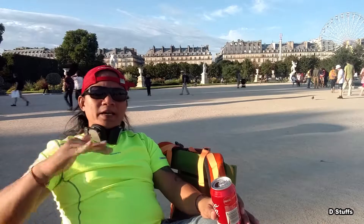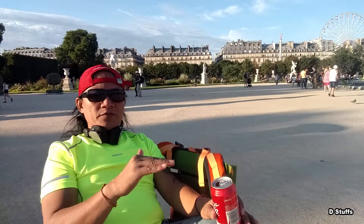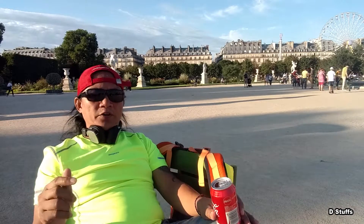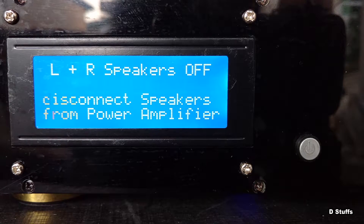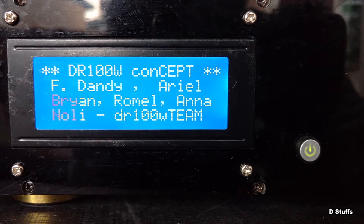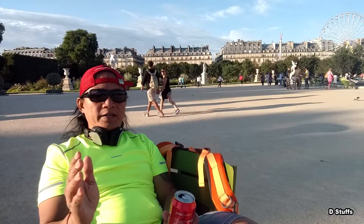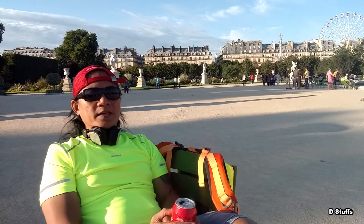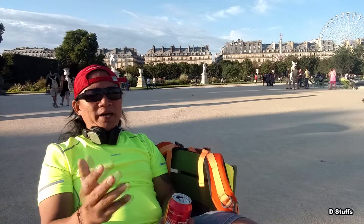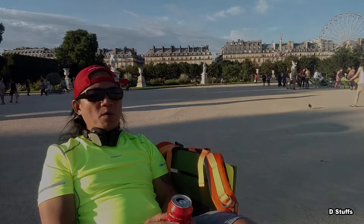Another example from my playground in amplifiers: if I would like to turn off the amplifier at a specified time — turn off means putting it into deep sleep mode, so no sound and standby current is very minimal. Let's say I open my amplifier at 10 o'clock in the evening and I want to turn it off at 12 o'clock midnight because I'm already sleeping. Without knowledge of microcontrollers, you may not be able to do that with just a one-shot timer like the LM555.